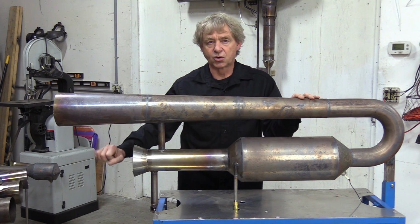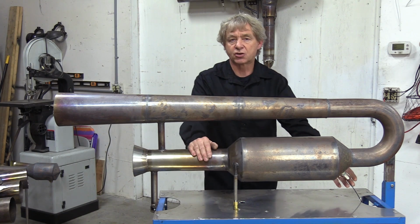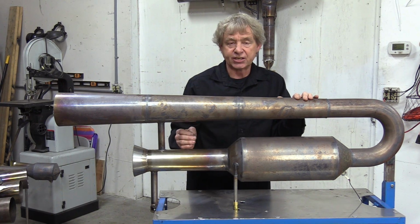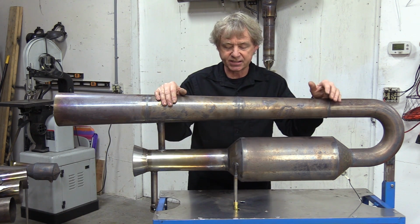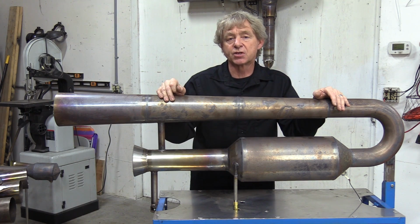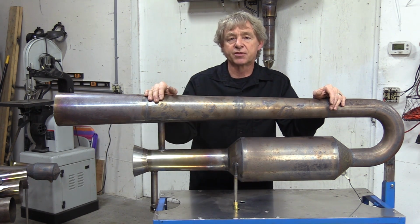You don't have to have a leaf blower or air to blow into the nose of the engine. All you have to do is turn on the spark and open a ball valve from a propane bottle, and it shoots propane in so quickly that it just blasts to life and starts running instantly. And then as soon as that happens, if it's a diesel engine, you just turn the fuel pumps on, it takes over on diesel, and then you're running on 100% diesel, you just turn off the propane.